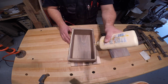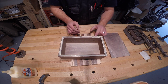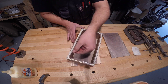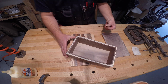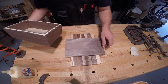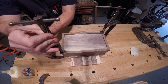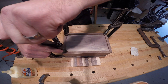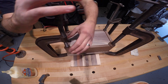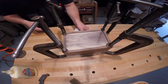Once that's done I glue the lid piece on. I run a bead of glue around and smooth it out, using a squeegee technique with my thumb and index finger to get the glue to ooze to the outside. I want the glue on the outside half of the thickness of each piece. I use four C-clamps to hold the lid on and let it dry, making sure it's nice and square with a little bit of overhang on each side.